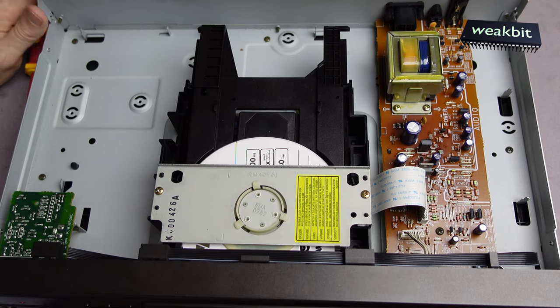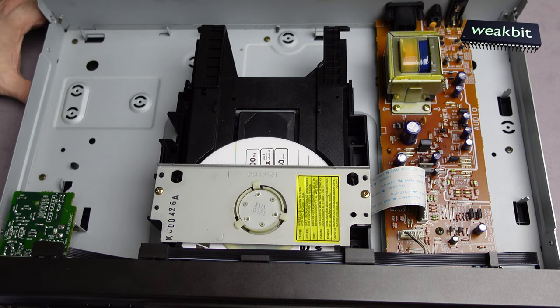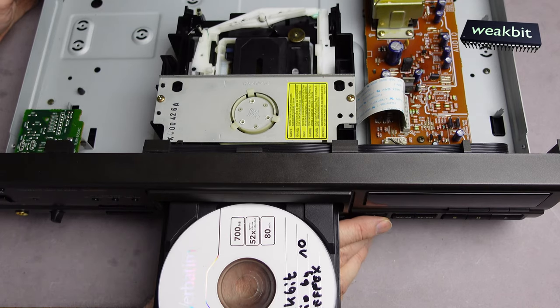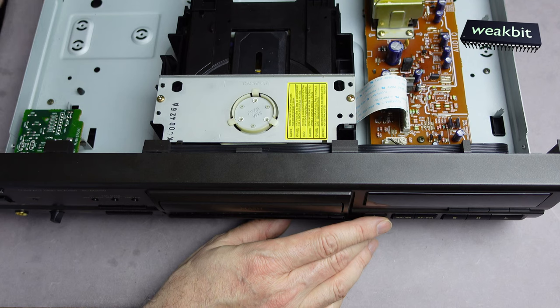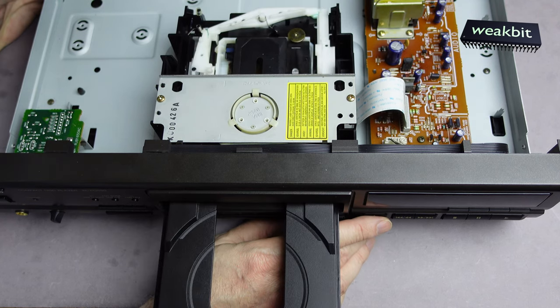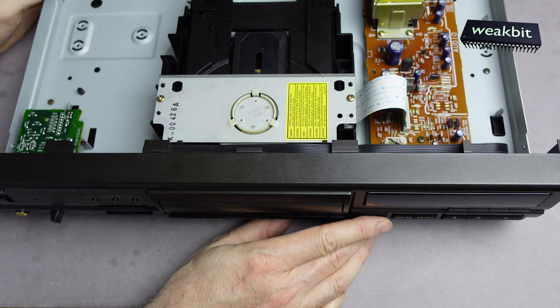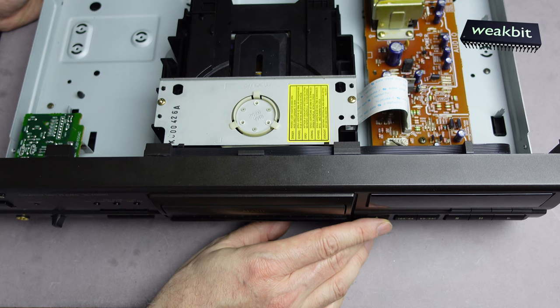We look at the plan because I'm not so familiar with Technics machines — and it's switching off. It doesn't spin, but the tray in and out is going — that is working. The machine also doesn't spin here, you can't see the laser. No laser light, no spin.